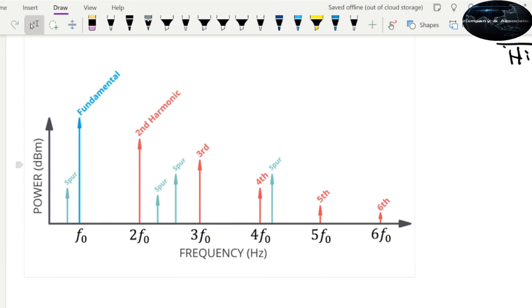You can build an FM transmitter from a pre-amplifier that was converted into an oscillator. The oscillator itself oscillates at the fundamental frequency, and then at every subsequent harmonic, up to the 19th harmonic. You can see at the 6th harmonic, the amplitude is already low here. Think about the 19th and beyond that.